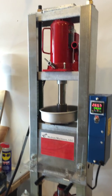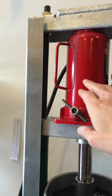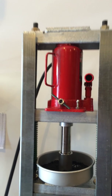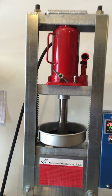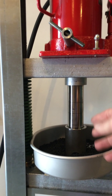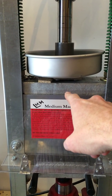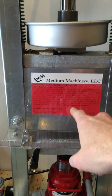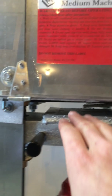Now the pieces of this thing — the top part here is a ram jack. I've got it set up as a 20-ton jack pushing on a ram. It's a big steel beam with a cylinder. There's essentially a cylindrical injection chamber that goes all the way down to this level, and the mold actually fits in this area.